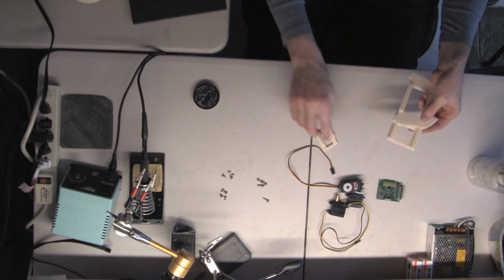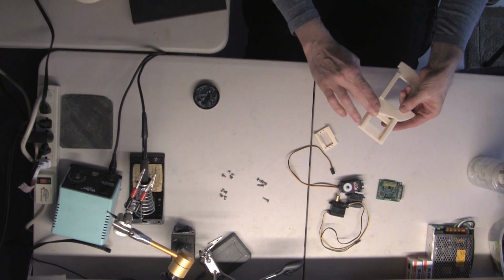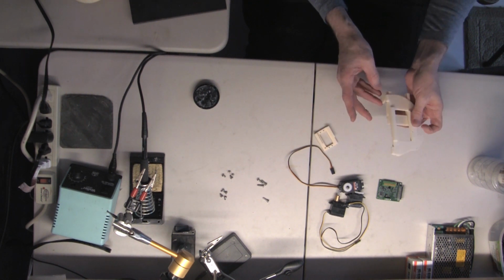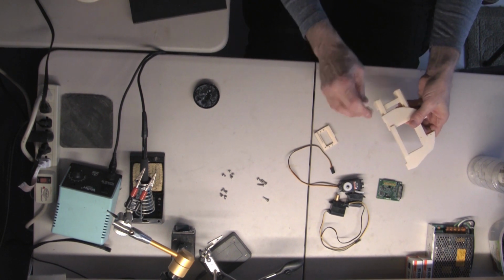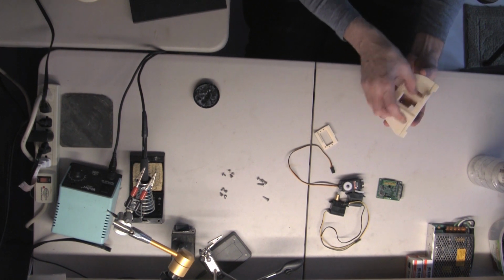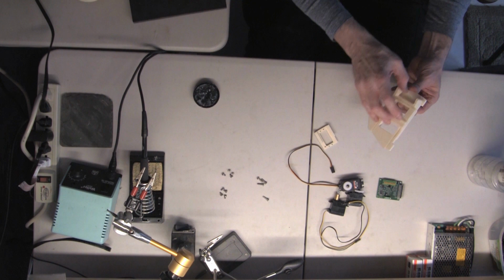And so maybe if you had a little extra grease and you rubbed it on those rails, that'd be a good thing to do. You can do that with the grease that comes off of here. Rub it right on the bottom rails. That's so that there's the least amount of friction that you can get, and yet there's still control over this piece. Now that's moving nice and smoothly.